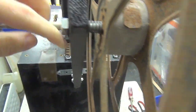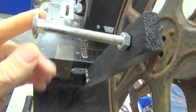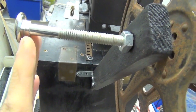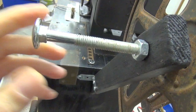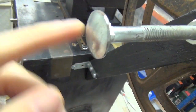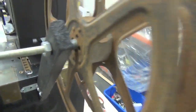That's the take-up spring arrangement. There's no clutch system with this — I've abandoned the original take-up spindle — so it will have a sprung metal belt which, if things go right, will slip as needed to act as a clutch. Spring metal material is generally quite expensive, but those spring metal things with plastic covering used as hand curtains will probably be okay once I remove the plastic. So that's the take-up.